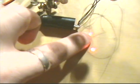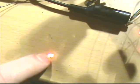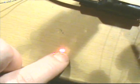And the laser diode is flat, and so if it's focused nicely with the lens that they have inside there, you'll have a nice little almost flat line, which is going to be your actual laser beam. But like I said, if you burn it out, it'll be dim, and it'll be a perfect circle, and kind of fuzzy, which is the way to figure out if it's burnt. If you got it all hooked up right and everything, and it just doesn't seem to be getting very bright, it means that you might have already burnt it out.